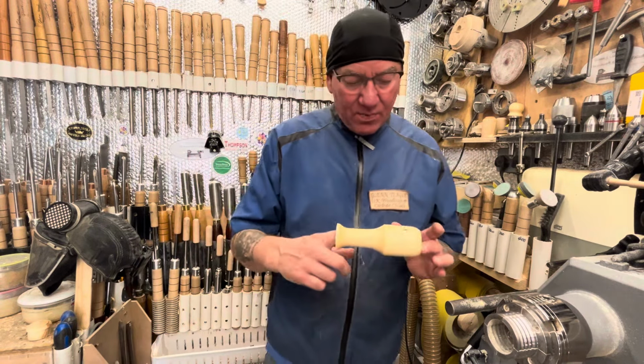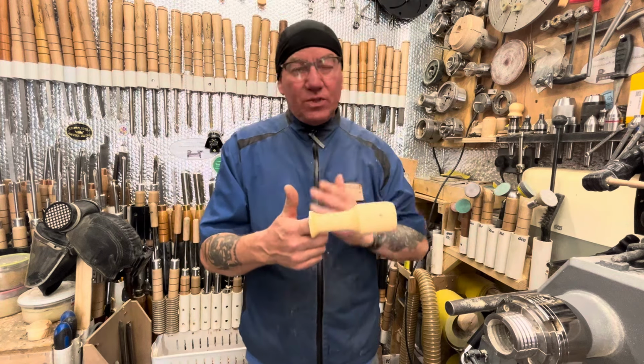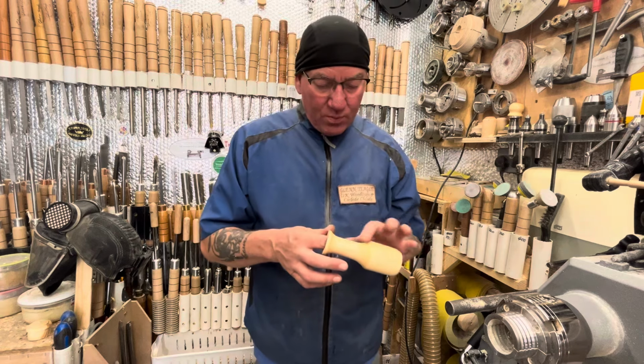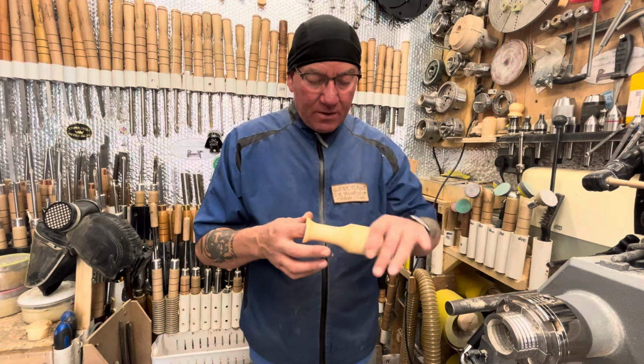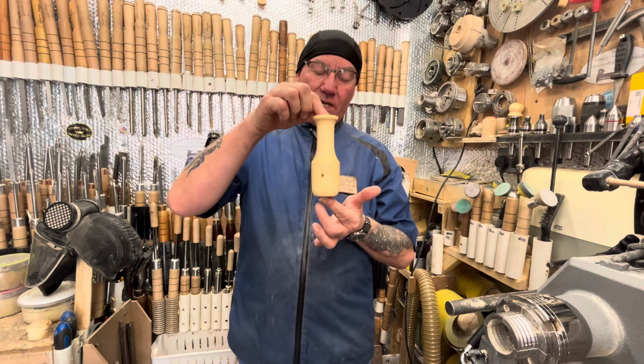And when you're doing your carbides, like I said, if you come in and do the cuts like that and cut the wood, don't scrape it. Carbide is no good for scraping. It really isn't. It will pull those fibres out, and once it pulls them out, it goes deep. And there you go.